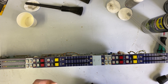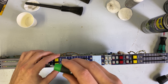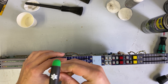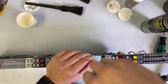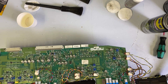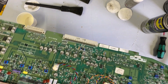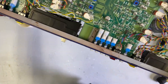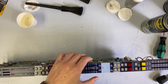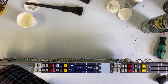As far as taking the module apart, what I like to do is just loosen the fader screws — these hold the faders in. We're just going to loosen these, not take them out, just a couple of turns. You really only need to do the top faders because that's the only thing connecting the board. What the board is actually connected to are these little steel pieces right here. We'll loosen those screws just a little bit too, doing the same procedure on the top one as well.